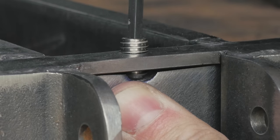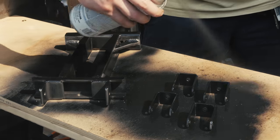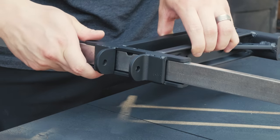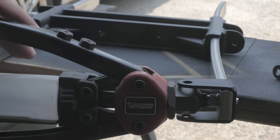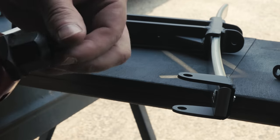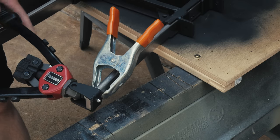I'll use those holes to attach the little brackets to each end of the limbs. That little notch in the limb left over from the hole in the middle of the spring — I drill and tap into the U-channel, and that lets me use a stubby little hex Allen screw to lock the limb into the U-channel. I was feeling creative with the paint job so I did matte black — comes out looking real crispy. With that dry we slide in the limbs and rivet each bracket on. Shout out to my OGs who remember the trick of putting a nut on the rivet post to extend the reach of the riveter.